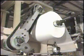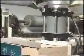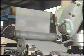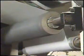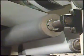In order to increase absorbency, the pad is sprayed with polymers and then wrapped and trimmed around the absorbent body. The automatic joint absorbent rack is operated in the turning around manner. There are 2 racks, one of which is in use and the other one on standby. When the absorbent sheets on the one rack are about to run out, the electronic monitor will alarm the system, and the standby rack will carry spare absorbent sheets to the operating position. This allows it to automatically continue the process.